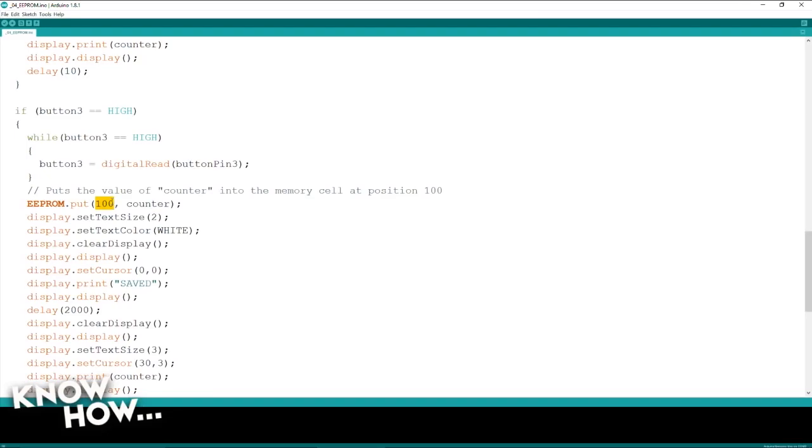I could choose anything from 0 to 1023, because I've got 1K of memory. So it's 1 byte memory cells. So 8 bits, 256 possible values. So just know that it's 256. If I want to store a value that's higher than 256, I have to do some creative math to cut it up into multiple cells.